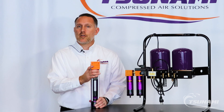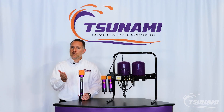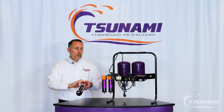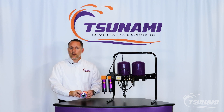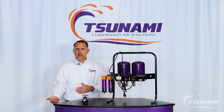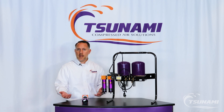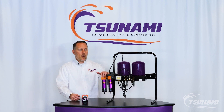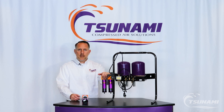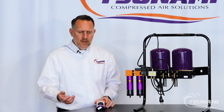So if that is a concern in your application, then you need a dryer. There are different types of drying technology available. Our regenerative dryers use a chemical drying method. There are refrigerated drying methods that simply cool the air and separate that water at that point, but there's still some vapor left in that air that can condense out. With our drying technologies, the chemical reaction will remove that vapor, so even if it cools later, you will not have liquid water appear.